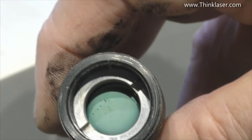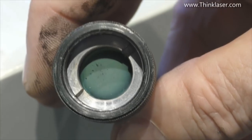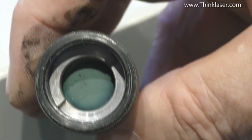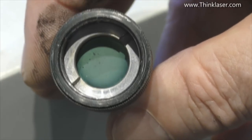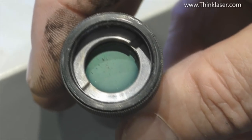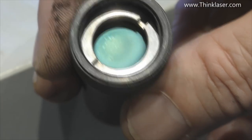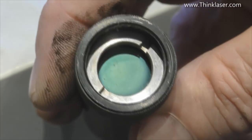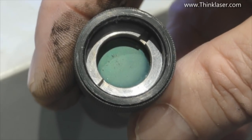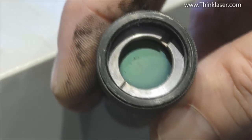This lens is covered with an anti-reflection coating. The infrared rays will hit that solid burnt-on material and heat it up, heating one face of the lens — particularly the center — and that material will start to get burnt onto the coating. Not only does it get burnt onto the coating, but it also reduces the efficiency of the light being transmitted through the lens. I cannot explain to you how crucial it is to keep your lens clean.